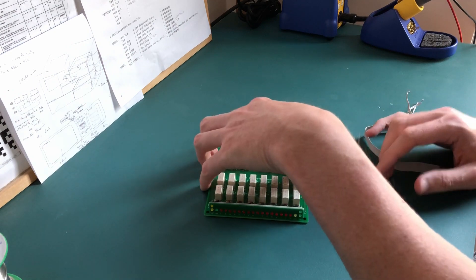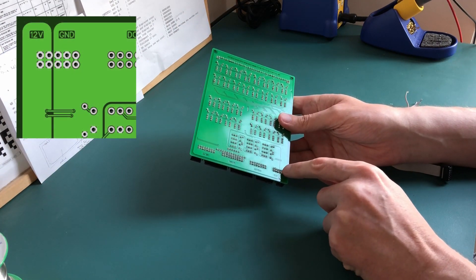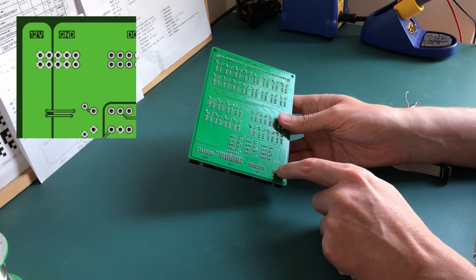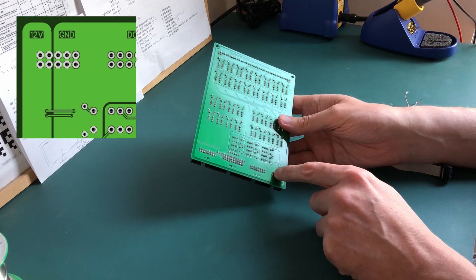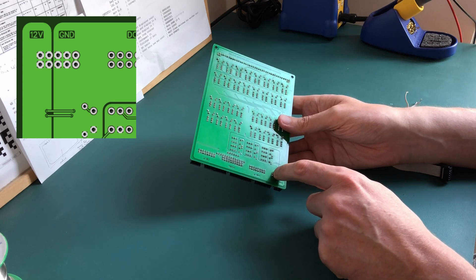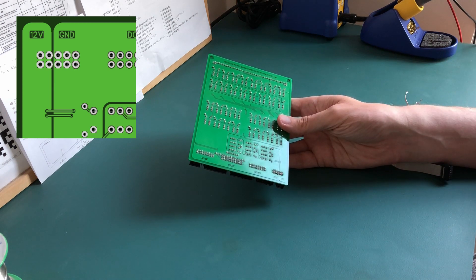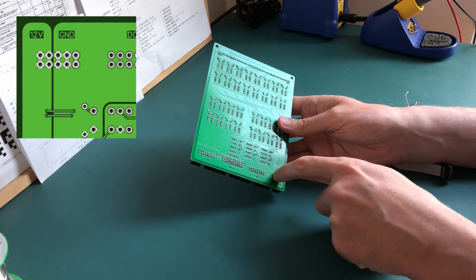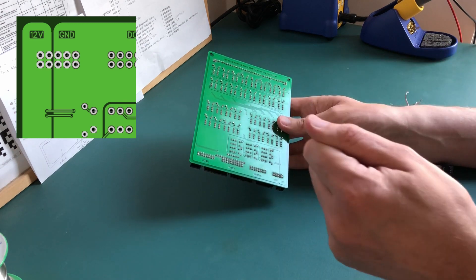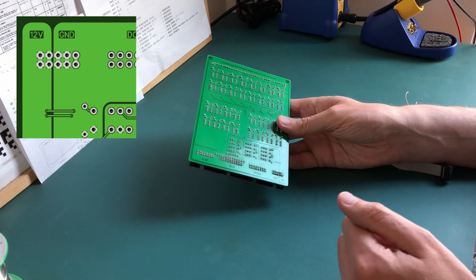What this will do is allow me to pick up the connections on the back here. I need to bring 12 volts into the leftmost pin and then ground into the middle. The end one is actually what's called the V-diagnostic, so that will power past the computers that can be switched on or off depending on what you want to do. All the switches where you can control the individual bits of the computer by hand will only have power from this bus, which means you can turn that off so you can't accidentally get the computer to do something you shouldn't be doing while it's turned on.